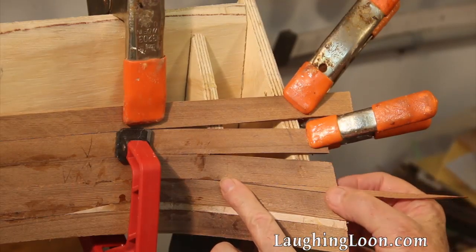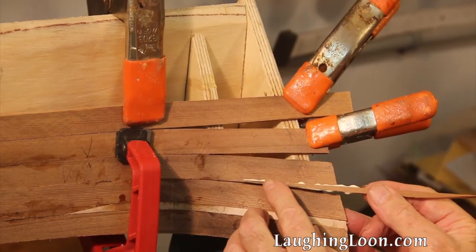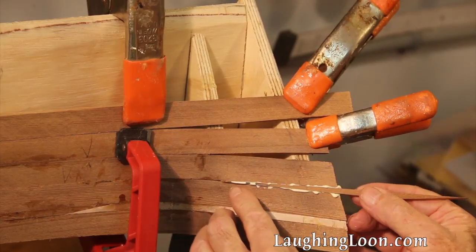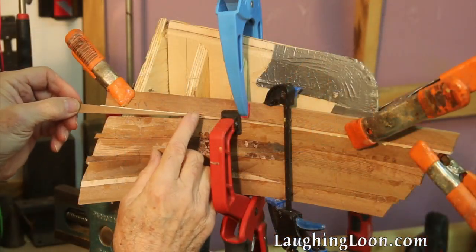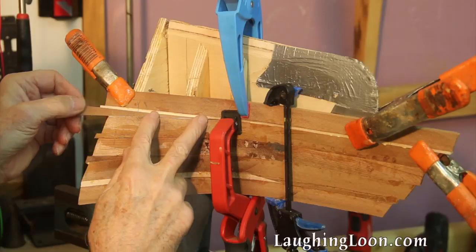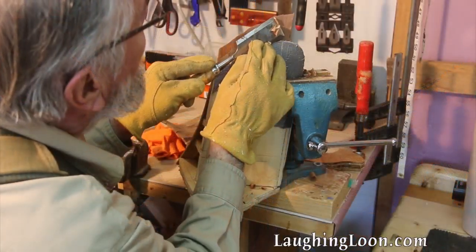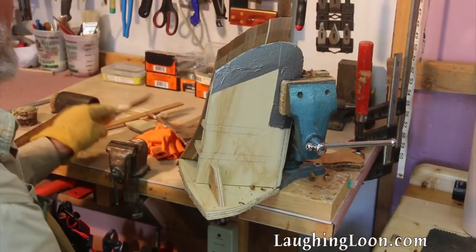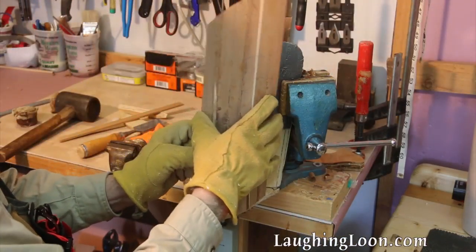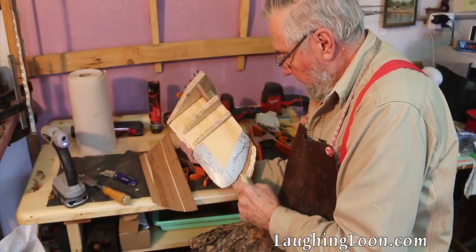Fill the wedge-shaped gaps along the number 11 station with tapered wood pieces of the same color. Bevel the stem end of one of the strip sections to mate with the other side. Join the two sides over the tail form.